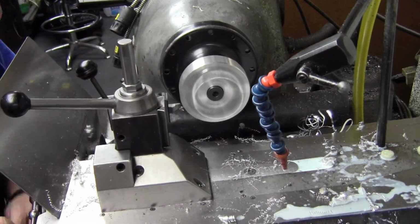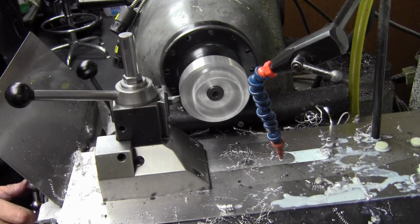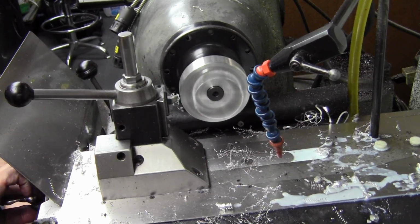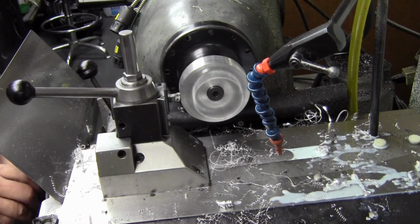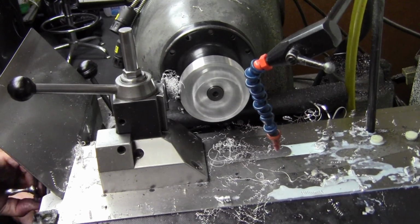Now we'll do our grooves, and now this I'm just using the dials on the hand wheels and doing like a 0.1 spacing, going in there with a V groove tool, just putting circular grooves to hold the lap slurry. You can see I'm just plunging in there and moving 100 thousandths plunging.